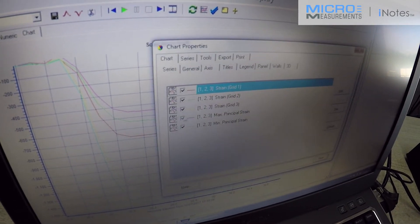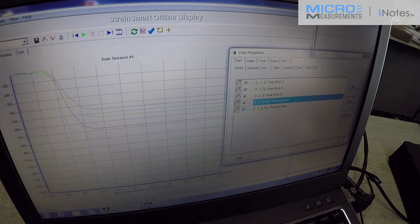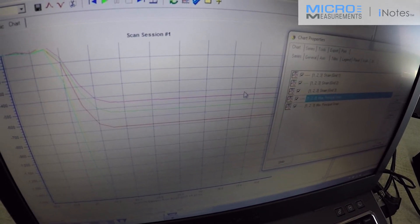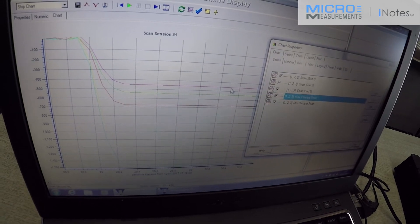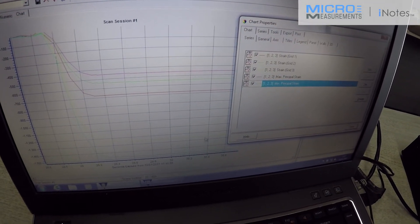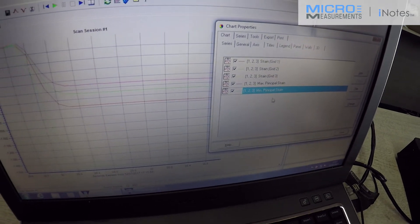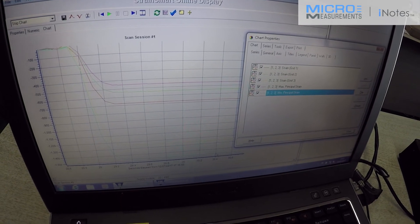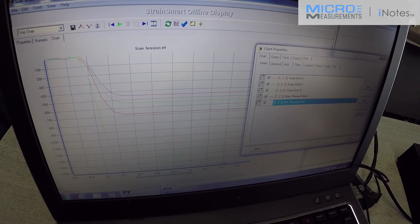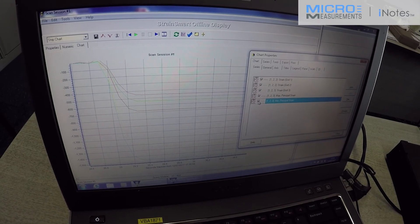If I double click here, I can switch various plots on and off. I want to look at the maximum principal strain — this is the least negative strain, and that's really important when strains go negative. This value is a higher value than any of the measured strains. The minimum principal strain is a larger value than the highest measured strain, but it is more negative, therefore it's called minimum principal strain. If I want to find the peak strain on this Coke can, it is actually this minimum principal strain — the highest level of strain. Effectively, we've released pressure, therefore we've got negative strains. This really shows the principle of a rosette: it will find the maximum and minimum principal strains no matter which direction it's mounted.